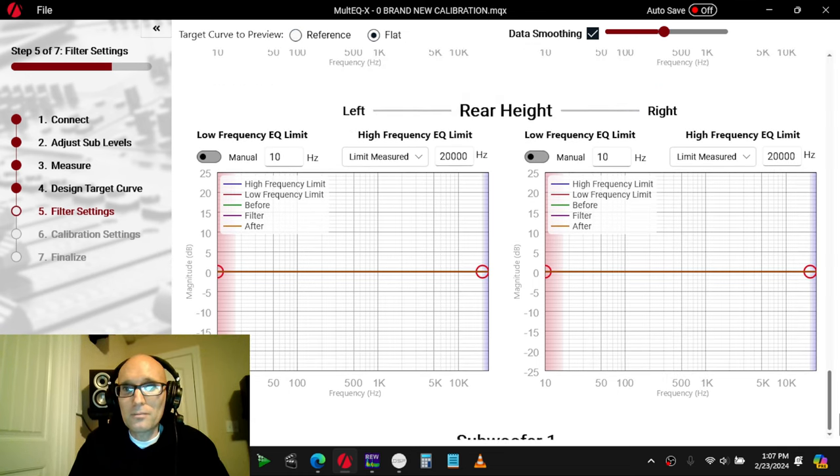So this is not a negative number, obviously, but if you do some time alignment in Odyssey, it can be the other way around. So if it said a delay of 1.79, it may be negative. Actually, it will be negative with Odyssey. So okay, 1.79. So we put a delay in on the right sub, 1.79. Okay, so let's unmute these now. This should be the response we get. Subs have fallen asleep.